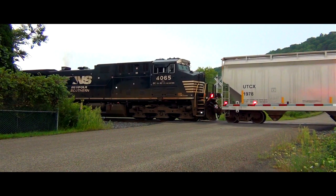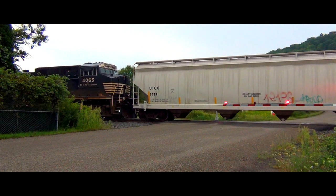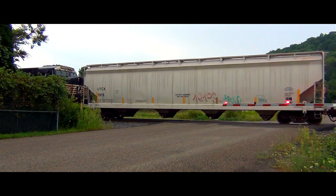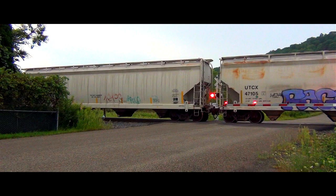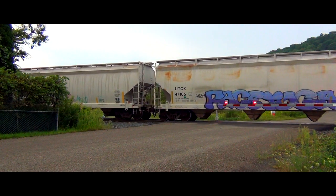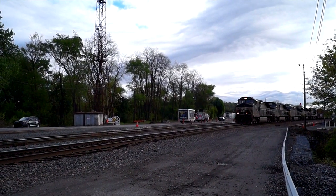In past videos, I raised the question as to why the BNSF decided to use the C4 A1A trucks instead of keeping the CC or six-axle trucks when it would seem that they lose a lot of tractive effort when starting or dragging a heavy train. Also said in past videos, the performance of a modern six-axle DC locomotive with a C4 is roughly the same. I think that they did this to upgrade their air brakes and electrical systems to make them more compatible with the more modern Dash-9s on the roster, along with the large fleet of ES44DCs and ES44C4s also in the fleet. At least that's what I was told.